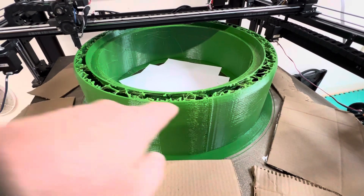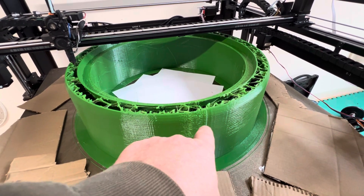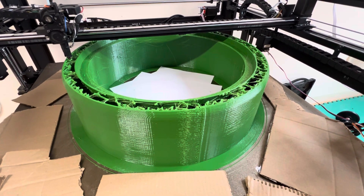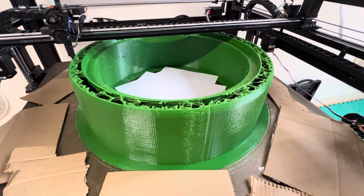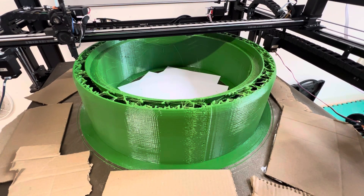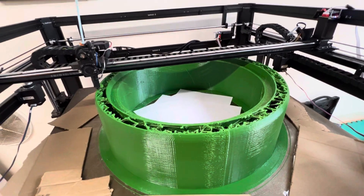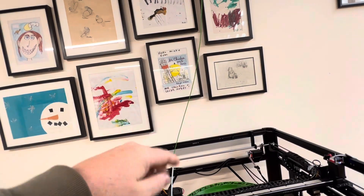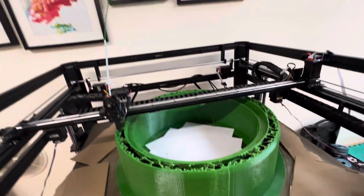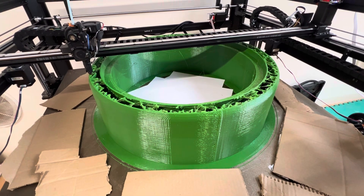One thing I've been playing with is not using smart seams at the moment in Orca Slicer, but playing with the overlap setting where it wipes back — I've set that to about 7 millimeters. With PETG, to stop the stringing on large travels I've set the retraction to nearly 12 millimeters, which is huge. You can actually see on the overhead camera that when it retracts the whole thing slackens off, and then I'm having to re-prime about 3 millimeters back into the nozzle on restart.